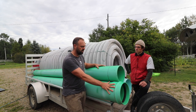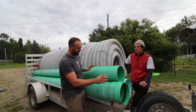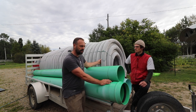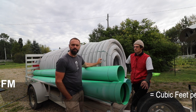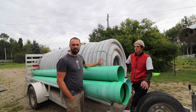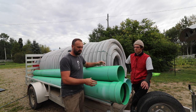These big pipes are going to act as the manifolds. All the air is going to come into one and leave out of the other. This is a 10-inch diameter water pipe — about $350 each, coming in 14-foot lengths. The air will accumulate in another one on the other side of the greenhouse. We're actually going to use perforated weeping tile. I was skeptical — these have enormous friction — but we modeled it based on 10 CFM per pipe. I figure these pipes can handle between 10 and 20 CFM at max, which tells you how big your fan needs to be. A lot of systems I see on YouTube don't really understand how air moves and how to properly distribute it through systems.